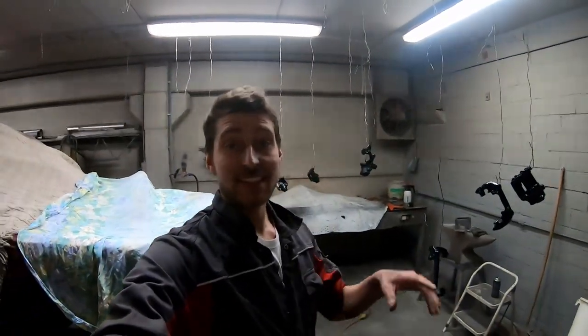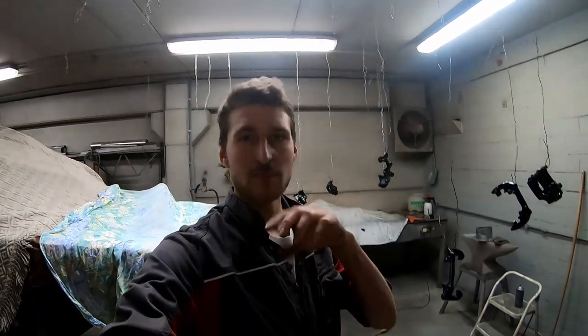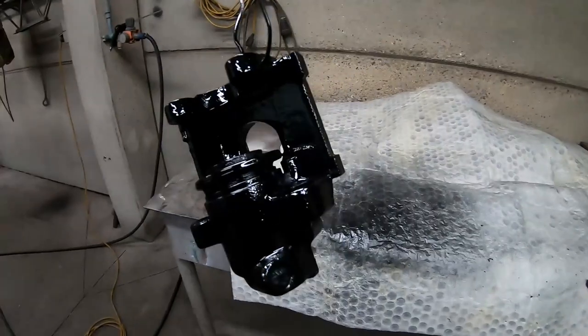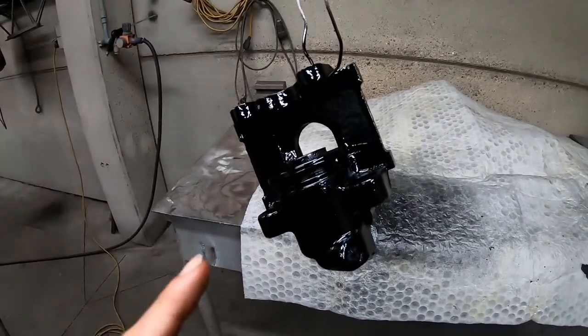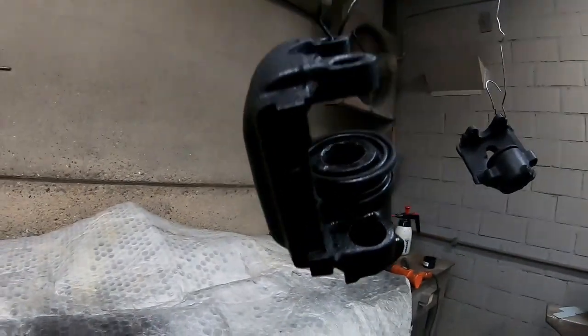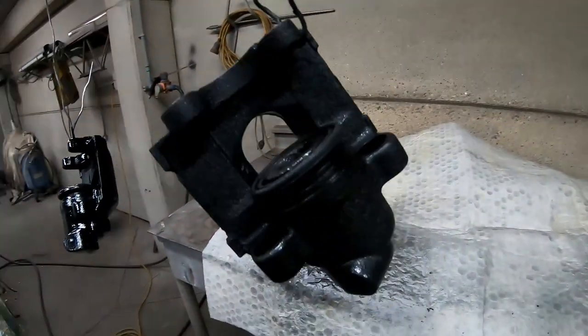Everything is painted. I heated each part up individually before applying the first layer so the metal has some temperature, then waited five minutes between layers. Everything has got three coats. At first glance it looks like regular black paint — this is because it hasn't been heat treated yet. You have to heat the whole thing up to around 70 degrees or so, and then something magical happens and you get this wrinkle texture.